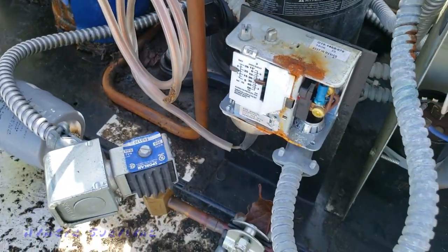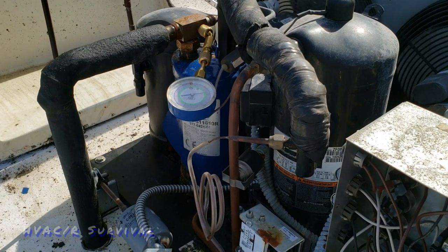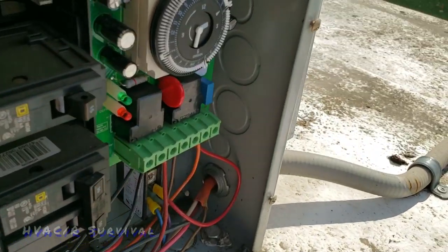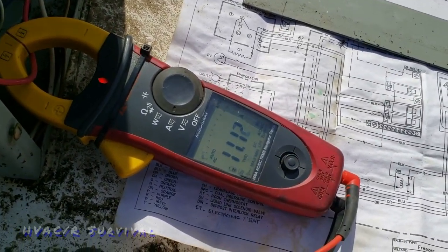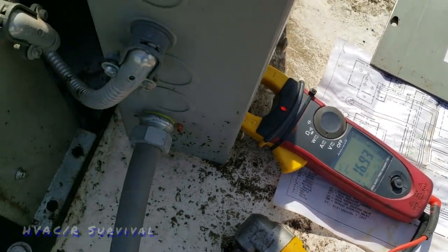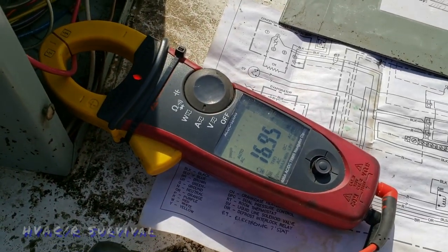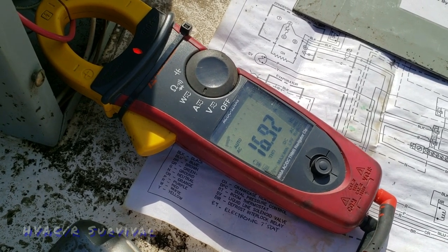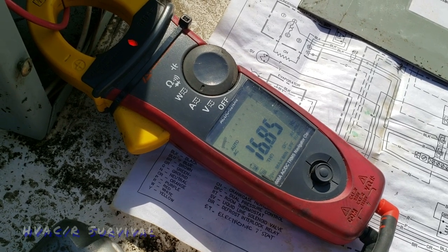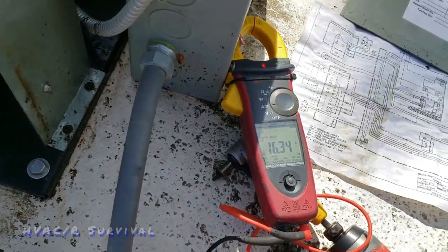The rust here is from condensation dripping off the suction line. Checked the pump-down again and made a couple adjustments - it was not set the greatest, but you're here for the original trip for low charge due to a leak; you don't usually have to go changing everything. Drop it into a defrost, make it pump down, watch our amp draw at the same time. It shut off at zero then jumped immediately back up. Amp draw is 16A - so if it came back on you could have 10 plus 16-17 amps rapid cycling, possibly causing the breaker to trip.